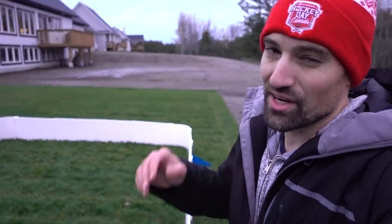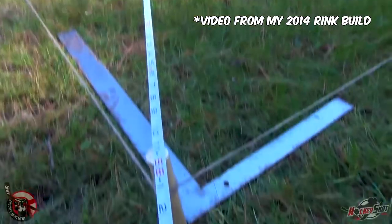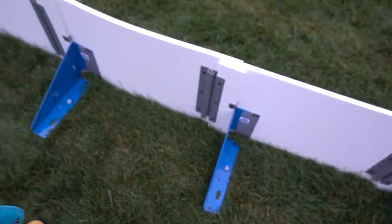We've got the boards, the brackets, and it's staked in — that's set up. On a scale of difficulty, it's certainly an improvement over older systems. With older systems you have to square the yard and do all these measurements beforehand because if you're off by like an inch they won't fit together. This one you can make adjustments on the fly. The boards fit together really easily, the brackets slide right in, then you just nail the spikes in and you're good to go. Nailing the spikes in is simple — no more difficult than nailing a nail into a board. They do give you a couple different spike locations, so if you hit a rock you can work your angles.